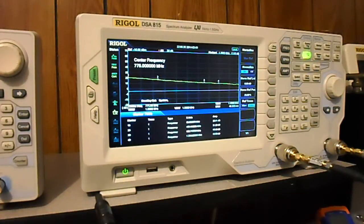I tried to verify the noise figure with the analyzer but couldn't see it through normal operation, and on my SDR receiver looking at the noise floor I couldn't see it either. If I can't see it on the noise floor, that works for me. With the other amplifier — the ZFL-1000LN with its nearly 2.9 dB noise figure — I could see it on both the analyzer and the SDR. It's nice that you can't see this one.